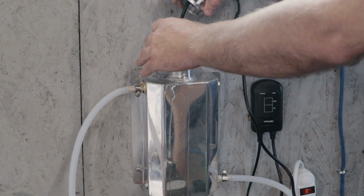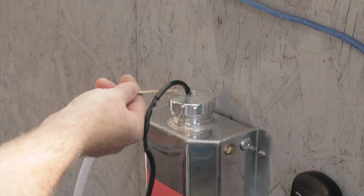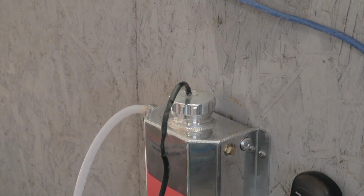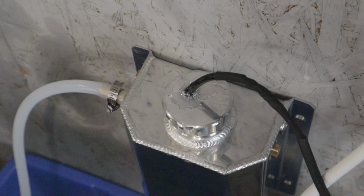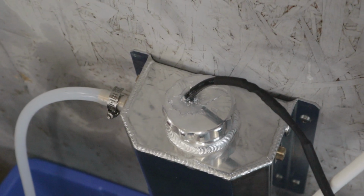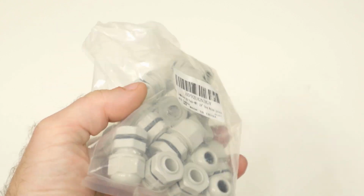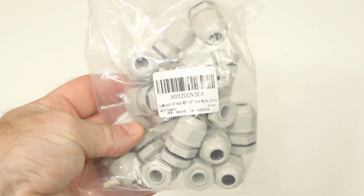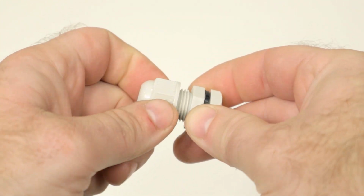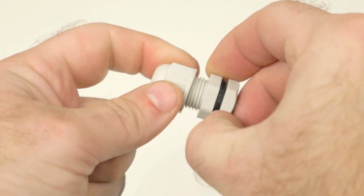When I first fire it up, water leaks out of the top hole where the wire goes in, so I added some silicone to seal that up. Unfortunately, I underestimated the amount of pressure this thing is under, and it still leaks past the silicone, even after having 24 hours to dry. I did some research on the internet and determined I needed one of these. It's a waterproof cable gland. I had to order them off Amazon, link in the description, and it was roughly the same price for a bag as a single.